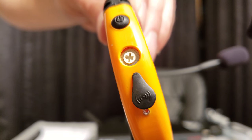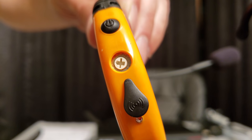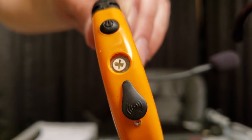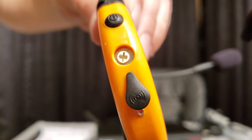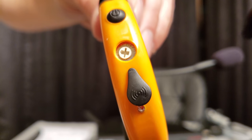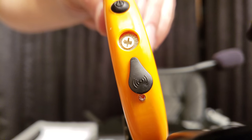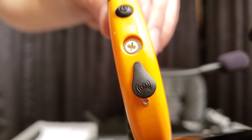You might not be able to see it on this video, but when you remove that cover there are little numbers in there that go clockwise in a circle — one, two, three, and so on up to nine, and after nine it says A, B, C, D. Each of those actually corresponds with the channel number. One through nine is channels one through nine, and A, B, C, D corresponds with the larger numbers like channels 10, 11, 12, and so on. If you have issues figuring that out, the product manual will help.